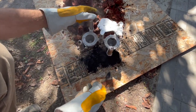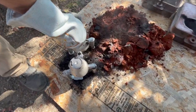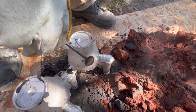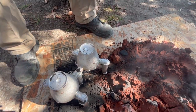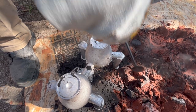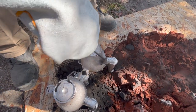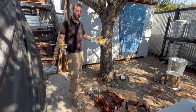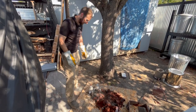Nice hollows on the inside. Over here this scaly bumpy surface is from the sand that broke off of the cavity and stuck to the pattern. Conveniently, the way that works is if you put a dent or damage in your mold, you can still pour your part and then just grind that off afterwards. But this is my current status of learning sand casting and I'm pretty happy with it so far.